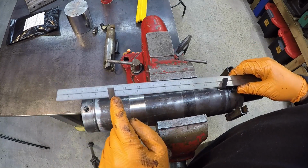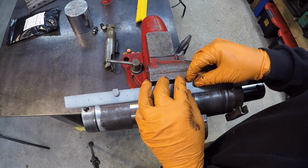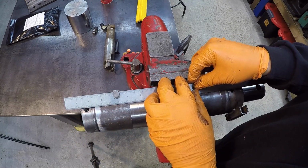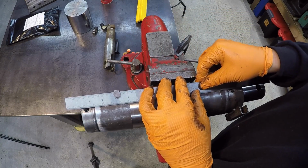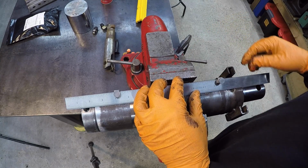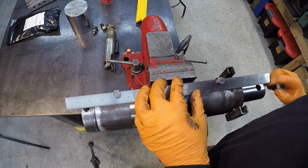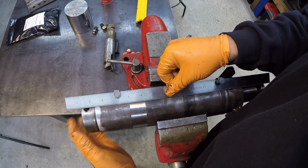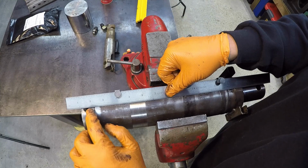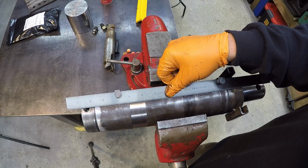Okay. Here's a cool way that you can align these holes visually, just by a sight right here with a straight edge. Use a set of these key seat clamps. Just clamp them to your rule and then just square it up. Just put the rule against your workpiece and the clamp over against the side, and it'll square it up perpendicular to the axis of the material there. And so I'm just lining it up with the port here, and then you can line it up with this hole here, and then down here I can just kind of rotate that and making sure that we're in the center of this hole here. So you're just using the straight edge there to make sure that we're in line.